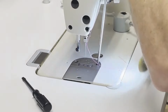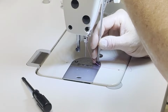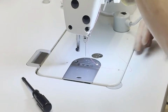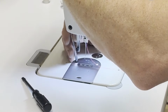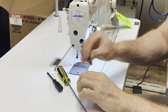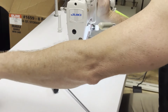Well, of course, we know the problem was that we pushed this machine too far, but there's different reasons that you'll get thread breakage. Another one that we found is that we forgot to readjust the tension, tighten it back down. Because every time we doubled down that layer of material that we were sewing, we had to loosen the tension some. And after changing the needle, the tech found that the thread kept breaking, and that's because there wasn't enough tension. So this was a really rookie mistake.